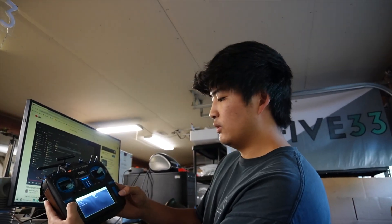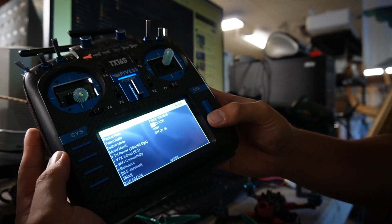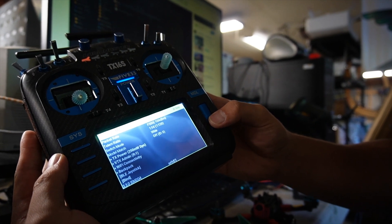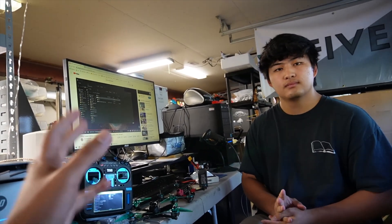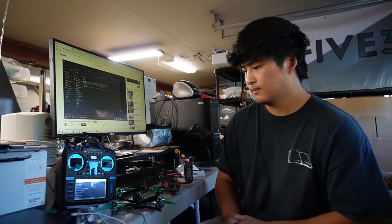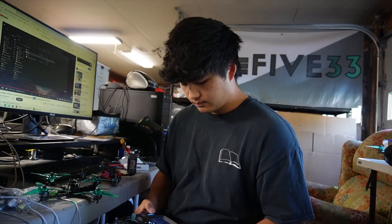So basically while armed you have your max power — say 250 milliwatts — and when disarmed it's variable. You leave your radio on all day and it sits at 25 milliwatts, then as you fly it jumps to max power. For truly dynamic power — like for long-range or filming — you wouldn't use race telemetry. You'd set the telemetry ratio yourself, or just put it to 'standard,' which gives the best telemetry ratio for whatever update rate you're using.